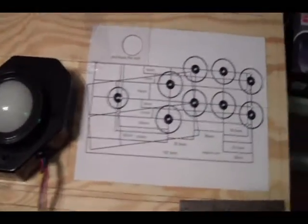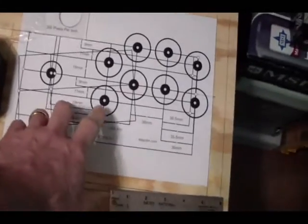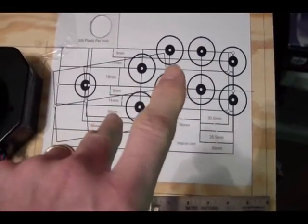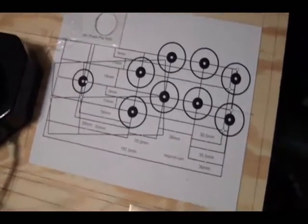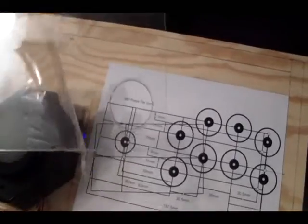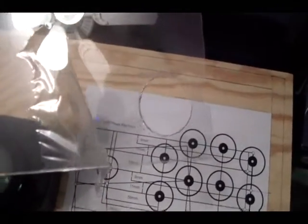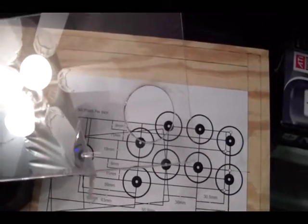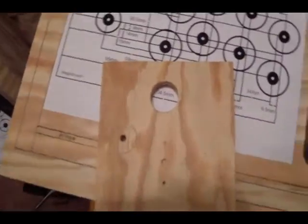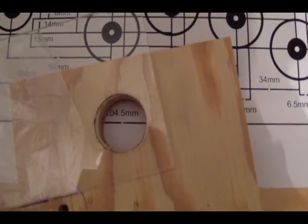I figured out a way to keep my holes for my buttons perfectly centered so the bit won't drift up, down, left, or right. We won't end up with buttons spaced a little closer or farther apart than what our diagram shows. What I'm going to do — I have a piece of plexiglass here, just a scrap piece from when I made the Mortal Kombat 2 panel. I already have a hole drilled in it, probably where I was testing my hole saw. It's the exact size of a Hap push button, 1-1/8 inch. If you hold it over our test hole drilled in a scrap piece of plywood, it's pretty much perfect — it goes right over it.